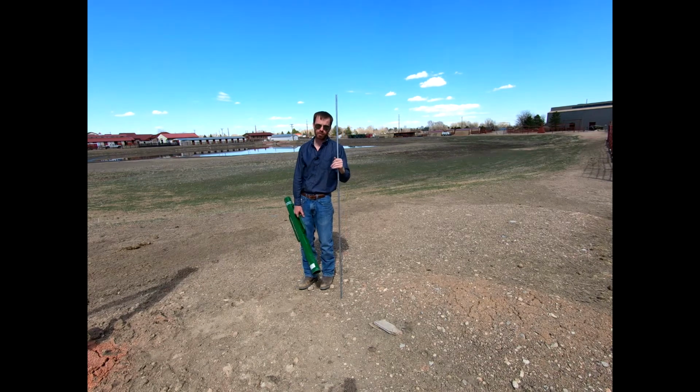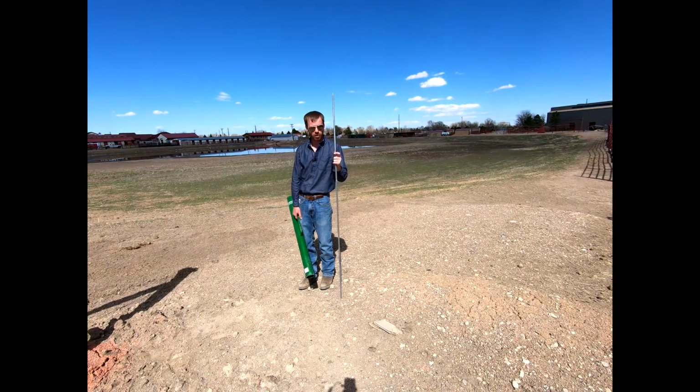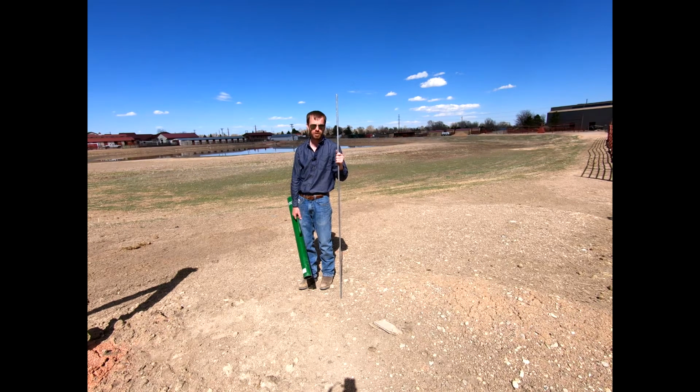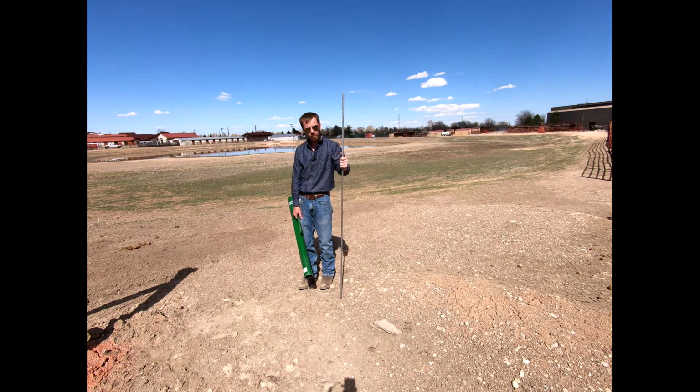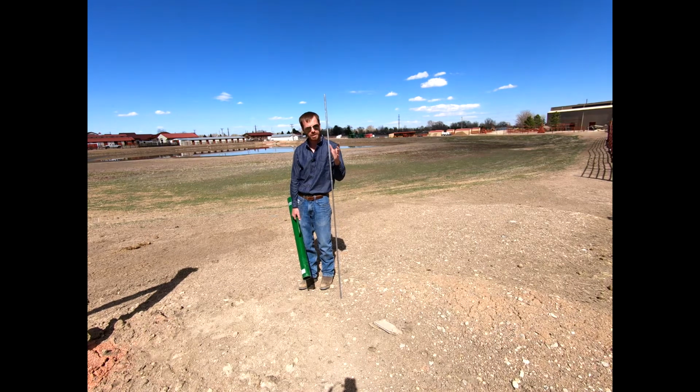So first part, we're going to go ahead and start installing our electric fence system today, and we're going to install our grounding system first, okay? Doesn't really matter the order. Traditionally, again, I already told you, and you saw that schematic, we would use 3 different grounding rods, 6 feet into the ground, 10 feet apart. We would tie them all together with a wire, and we'd have this excellent grounding system. For the sake of today, we're just doing a quick demo, and we still need a ground. We're just going to put 1 rod in the ground, but you know that we are going to traditionally do 3, to make sure we have this excellent grounding system.